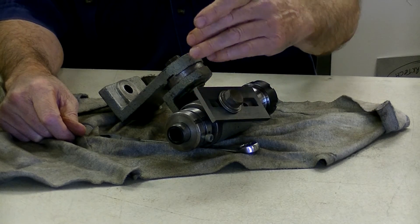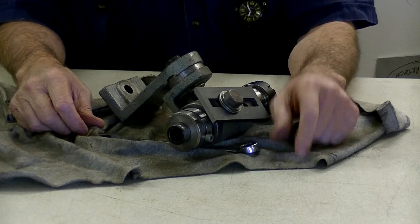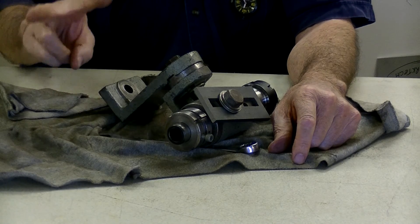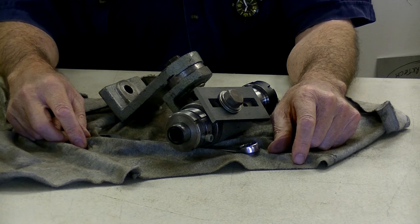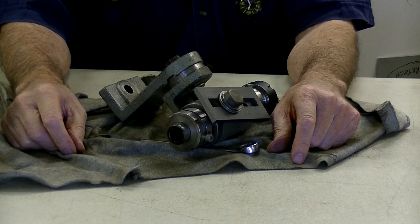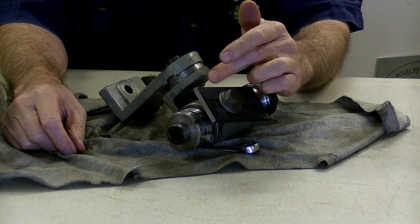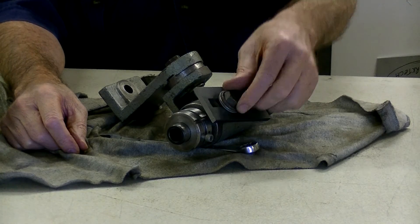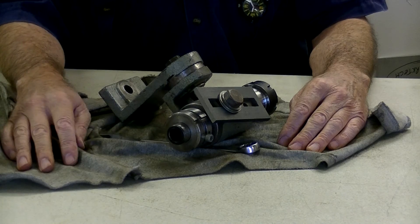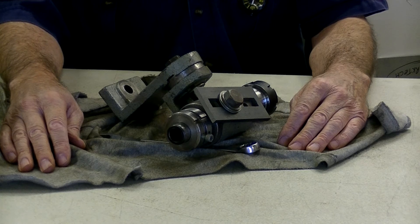Although their cam might have a curved profile instead of a straight profile. If you get onto YouTube, there's a fellow called George Hegg who has done two very good videos on using a Clarkson drill grinding attachment. If you look at the attachment — not just what's happening in the grinding video — you'll see there is an angle plate for a cam on the Clarkson, marked off and adjustable for angle, lockable with an adjusting screw. Look at those two videos at least twice and you'll pick up a lot of good information on how to use the attachment and also how to build your own.